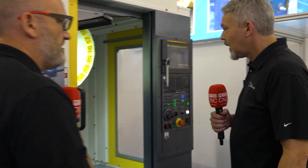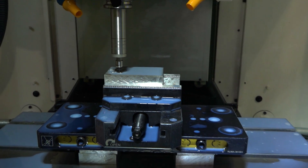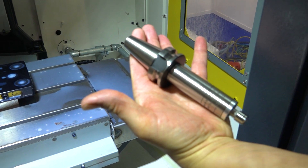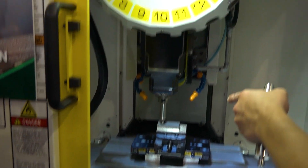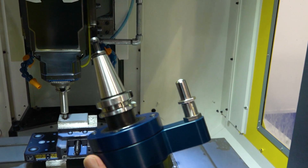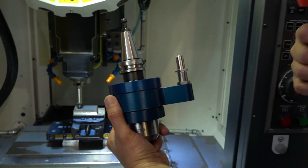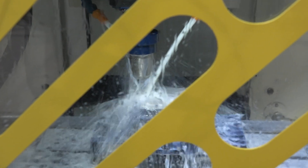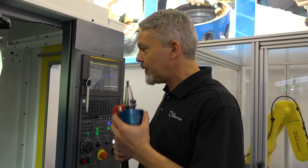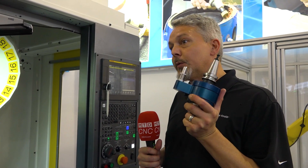This is our latest innovation — it's a micro spindle for small micro drilling, 3D surfacing and deburring. This is called the 600X and as you can see here it's a very low profile. Because of the amount of air it uses, it's very small — we're able to feed the air through the spindle without any extra apparatuses. For larger spindles that draw more air we use the system we call TMA, which automatically feeds the air into the spindle when it is engaged in its cutting position. This is fully tool changeable so you don't have to stop the machine, plug in any hoses, or have any downtime. Instead of running your high speed spindle at its full max for countless hours — which causes wear and tear — we put one of these in and get much higher speeds and much more durability with less wear and tear on your machine.